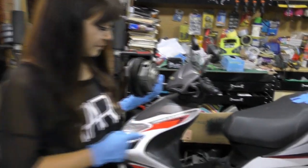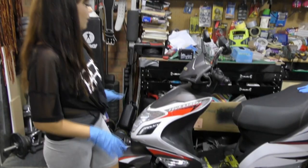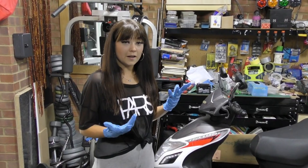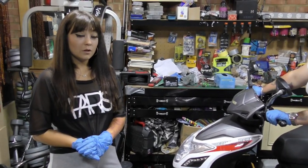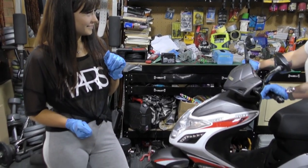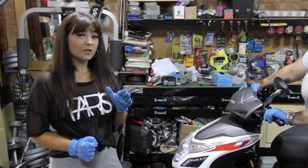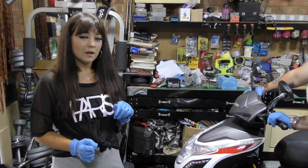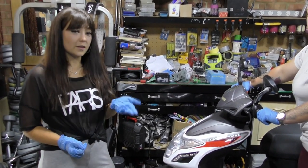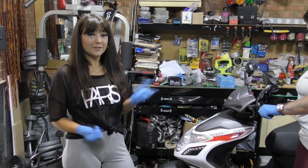We're going to have to leave all of this off, then we're going to have to have a look at the headstock. All the panels at the front are going to have to come off. And why are we looking at the headstock? What's wrong with it? The whole shank is banging backwards and forwards. It should have a ring of ball bearings at the top and at the bottom, and then three nuts that tighten them nicely down. We need to take all the panels off to see whether the nuts have come loose, or the ball bearings have just obliterated - and that causes massive problems. So let's get on with it.